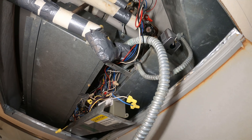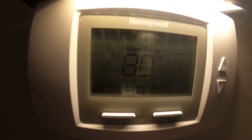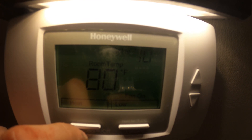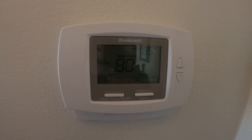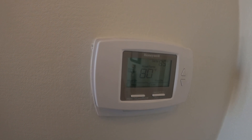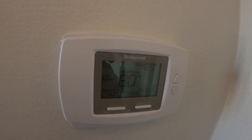That thing looks like a mess. We have some strange things going on over at the thermostat — if we look closely it says 'pipe sensor' just blinking, machine is off. I got it to go on heat and off, heat and off, nothing else. It's 80 degrees in this room, definitely super hot. Set the system to heat just to see what would happen, still got that weird pipe sensor, and for some reason you can't switch the system to cooling.